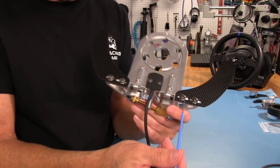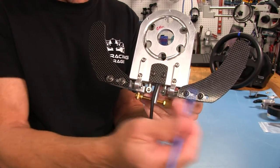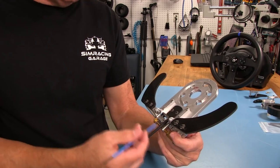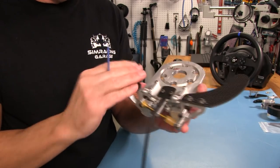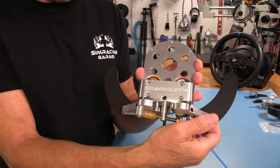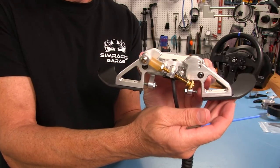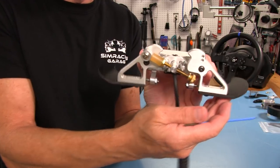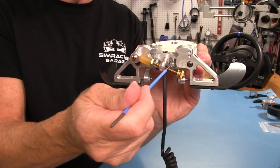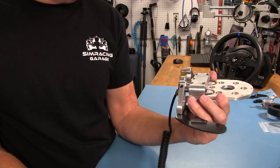The panels have a good amount of adjustability — we can slide them in and out to better fit the individual's needs. All of this is adjustable as far as the front stops go. You can actually turn the bars holding the set screws to change the angle of that stop. Adjustability everywhere you look on this unit. Looking at the front, this is the first thing people will notice — a big brass screw with a nice knurled piece. It has a spring on one side to maintain tension so you don't need a lock nut, and on the other side there are threads and a rubber bumper.